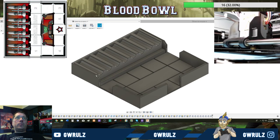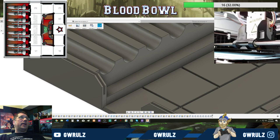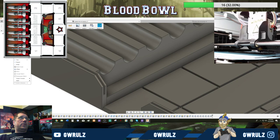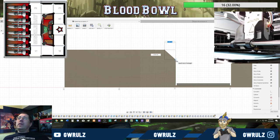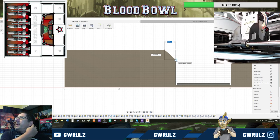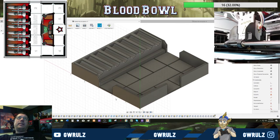And my wall actually stopped here, which, if you remember, let's draw a line so I can get you a, oh, let's do a 2-point rectangle on this. So I did a 5mm chamfer, so that's a 5mm section. So that gives me a door I can drop in there, and it'll be a 5mm wide door. So it's just a little, you know, thinking ahead.